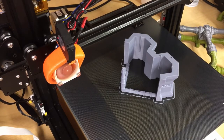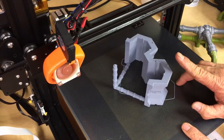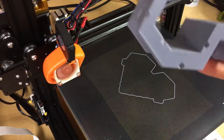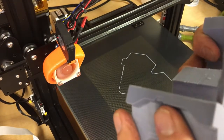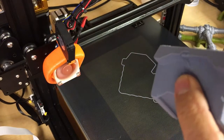So now we are at extruder temp of 28 degrees Celsius — room temperature basically. The hotbed right now is at 29 degrees Celsius, and there's air under here so it's probably one degree warmer — no big deal. We'll see how easy it is to remove. I don't think I can blow it off, but I'm going to see if I can push. That was crazy — you can hear the click. And you have to admit, the bottom of your model looks amazing. You can see a little bit — that's my leveling problem right there, but all of this is perfect: nice and smooth and glassy.